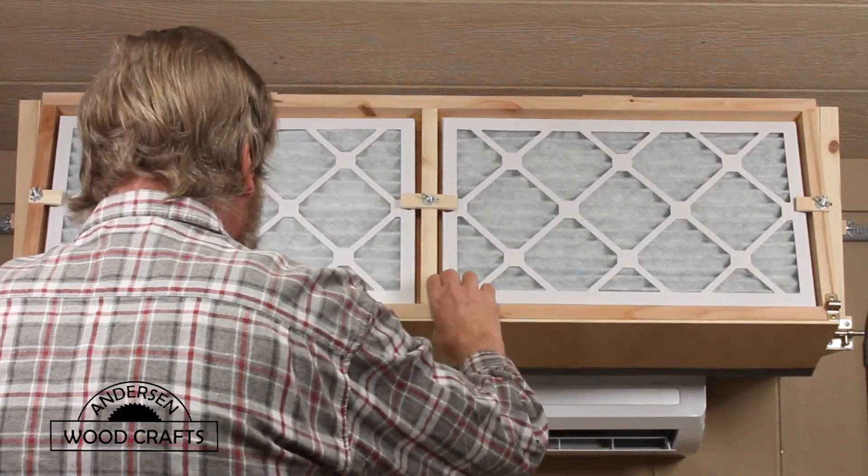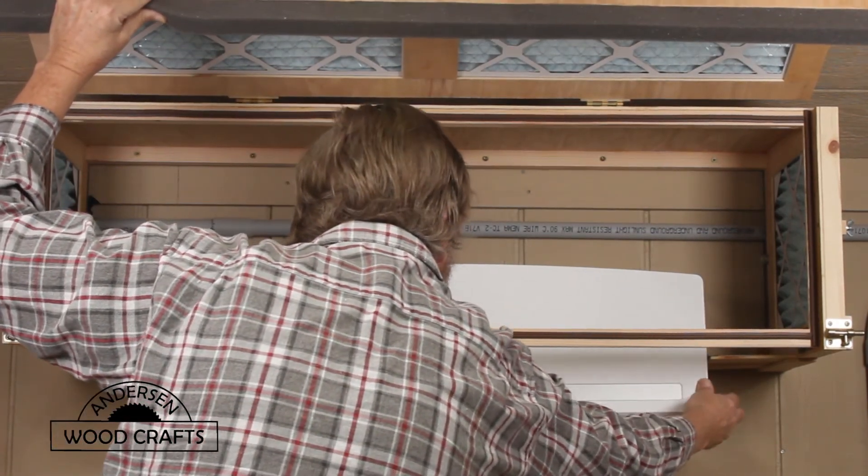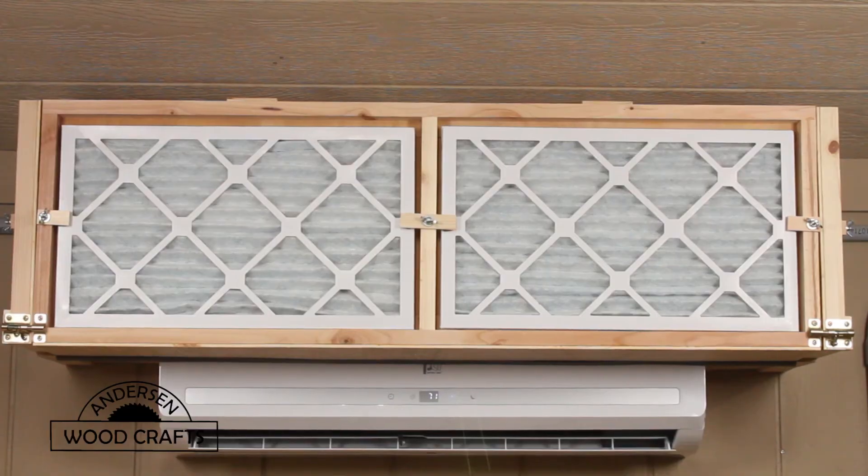And there it is up on the wall. The reason I put the front on hinges is so I'd still be able to access the unit to clean the filters inside the unit. I can't open up the front all the way, but I can get it open far enough to get the filters out. This filter box is ready for action. My space is very limited — that's why I use these size filters. I have two 12 by 20 filters on the front, and on each side I have a 12 by 12 filter. This should still supply plenty of airflow for the unit. I made sure that the top of the box was at least 6 inches above the unit and that there was at least 5 inches on each side. I hope you enjoyed this video — please give it a like and don't forget to subscribe to my channel if you haven't already. And as always, all you woodworkers out there, just get out there and cut some wood.